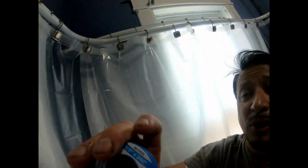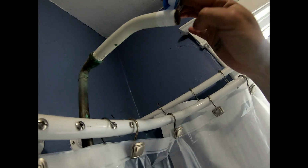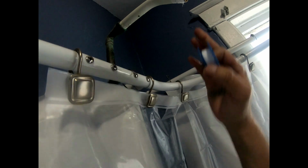You know you put your pipe thread on backwards if, when you're tightening it up, it's knocking your pipe thread off. So this is the pipe thread. I'm gonna have to put it around this way. I'm sorry with the camera, I'm trying to shoot it with one hand. So you put it around this way, so when you break it off, it's gonna end the way that it's screwed and it tightens up. That's good right there, you pull it tight. And then if you're leaking on the pipe thread, you didn't put enough on here.